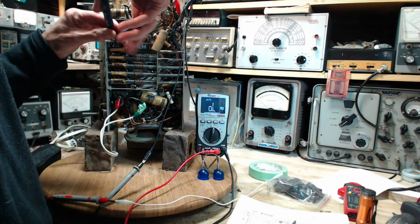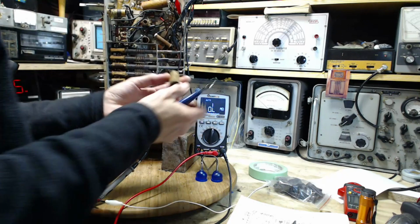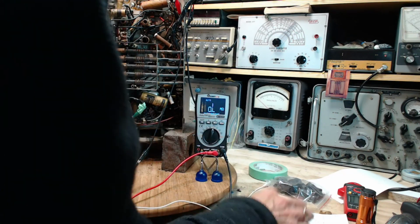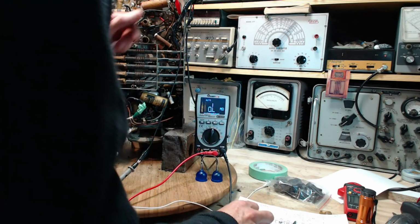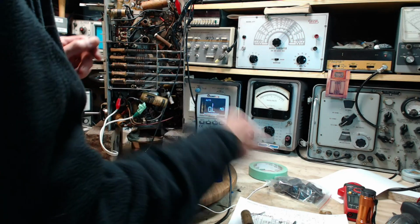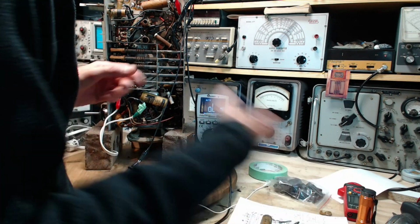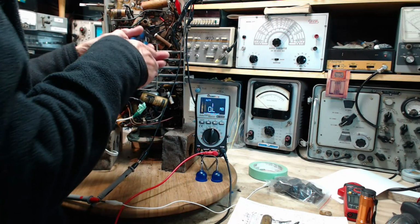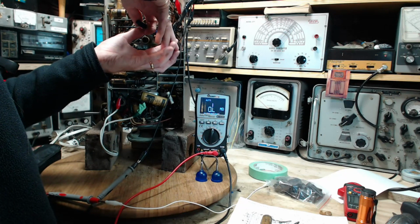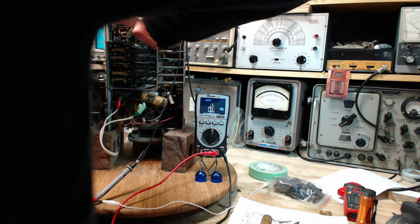Okay, let's take this right out. I think there's a .25 capacitor that is supposed to be going to ground from the terminal I just cut it away from. So I think that's correct. It's just kind of big. Now I can get at the resistor here. I'm going to leave some wire behind, or I know what'll happen. I'll forget. There we go. There it is.